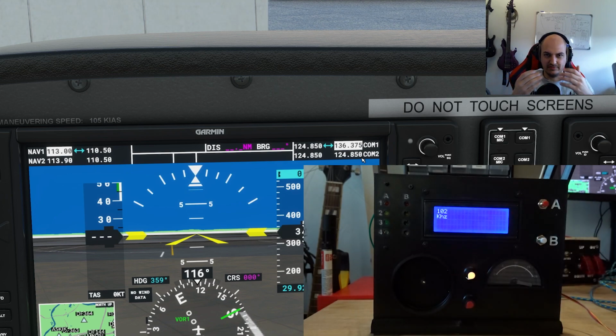Because a bit of background on the rotary encoder, it's going to check the state of two points. If it hits this one first with a wave, we know it's going leftwards. If it hits this point first, it knows it goes right. But for that, we need to store the last state of the pin and see what the state is now, if it's high, low, etc.